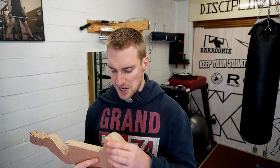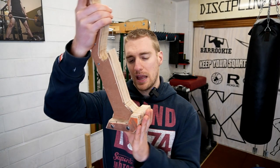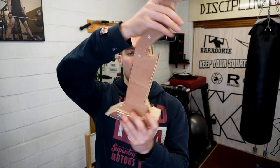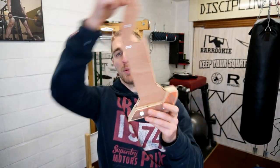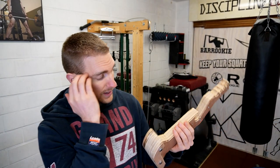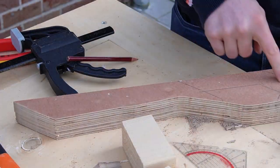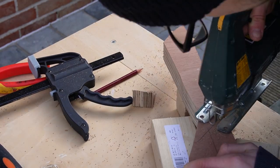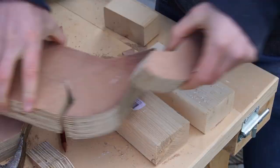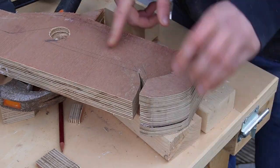What you also see with the Genesis jack is the bigger feet, and you're going to want these because you need a solid base when using the deadlift jack. This part here is also very important — if you don't have it, the deadlift jack can tip over. With this foot in place it can stay right in place, which is very good. For the feet I thought I could use some leftover parts cut out of the deadlift jack, but then I realized I had glued them together. Luckily, with a chisel and a light tap of the hammer I could open the two pieces of plywood and put one on either side.